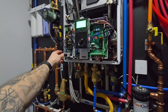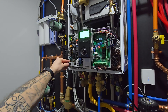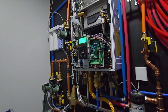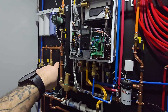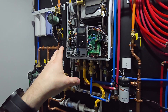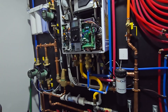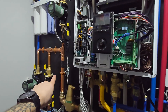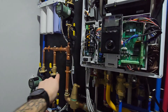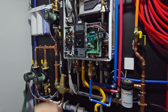I'm going to go ahead and shut this off in case it kicks on — it'll be a little loud trying to talk over it since the cover's off. So what that's going to do now is look at that sensor, and maybe if it's a few degrees lower, the boiler might actually have to make a few degrees hotter water to get you what you really want there. So if I have this boiler set for 125 and I'm only getting 120 here, it's going to say: okay, maybe I need to make 130-degree water to get you your 125 there.